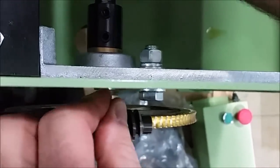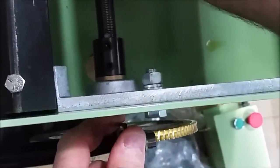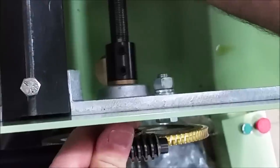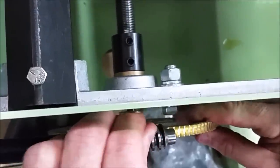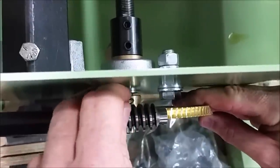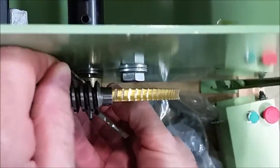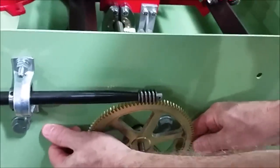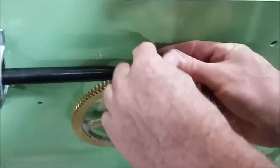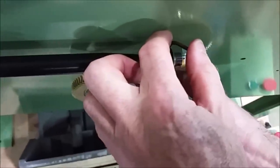So now I'm on the flat. Right now I'm loose and I can move the shaft inside. As I'm moving it, I'm tightening my allen wrench a little bit until all that slop is out of there. Now I can leave my shaft where it's sitting and move my gear back into position. I'm sighting down the center of it — I really want to make sure it's centered good. I pay a little bit more attention to this because that affects how this worm is sitting down into the middle of the worm gear.